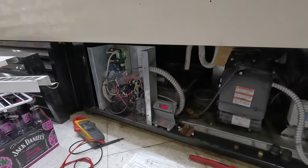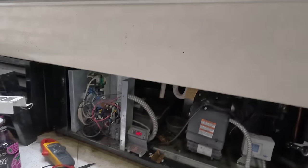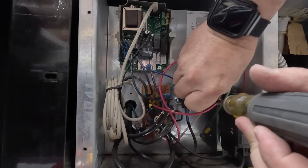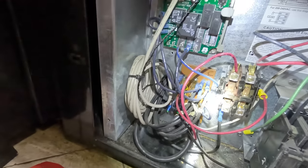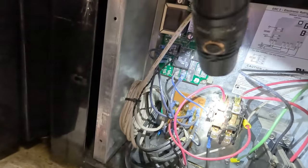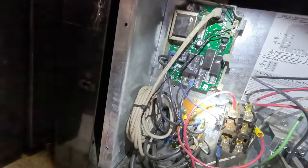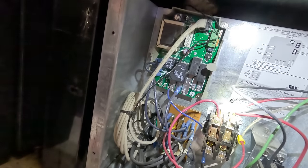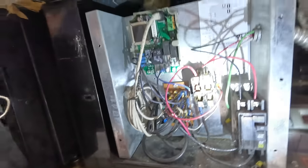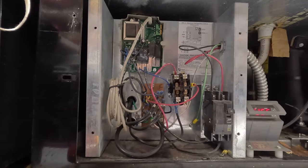We could probably grab the vacuum cleaner, sweep it out as it's melting, and keep dumping it into a bucket until we finally get it all melted. We could also do this with a pump sprayer. Yeah, the contactor looks a little burnt. So if you wanted to, you could have divided the power between the two legs and give yourself probably 40 to 50 amps capacity. It's probably rated for 30 or 60 amps. In reality it should have lasted longer. What I'll probably do is get a dual contactor and just divide it between the two — split top and bottom together, give you a little extra capacity.